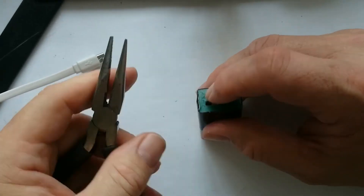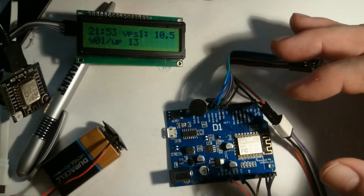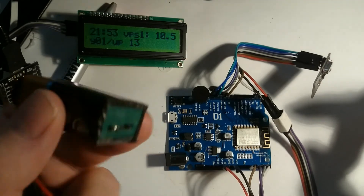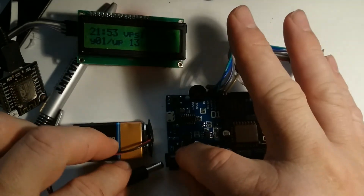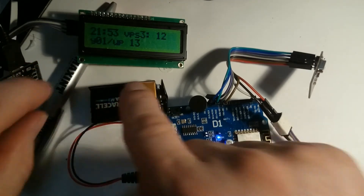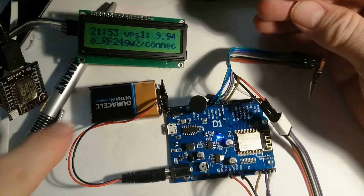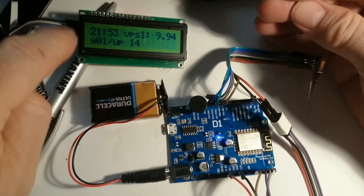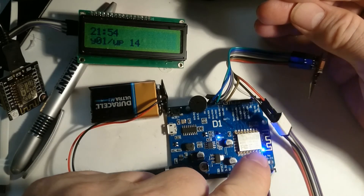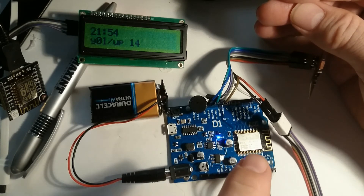The final step is to close it up. So what you see here is my wireless gateway — I will power it using the battery, and then you can hopefully see it connect. I connect it, and now nothing happens, but when I switch it on you can hear the sound. As it is trying to make a connection to the MQTT server, here you can see the connect message. This is another node that is currently also up, and here you can see a flashing LED which is the heartbeat LED, showing every second that it's still live.